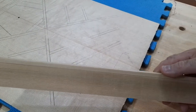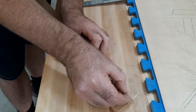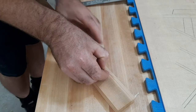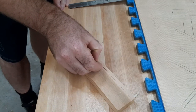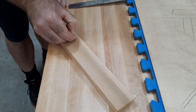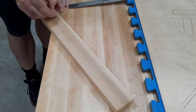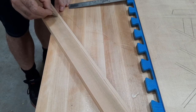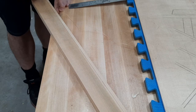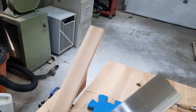Before you start cutting, grab yourself a knife blade and go at an angle to cut a small V-groove. Notice that I'm cutting on the waste side — you want the V on the side you're going to be cutting out, because you want to keep the good wood intact. That'll give you a track for your saw to run in.